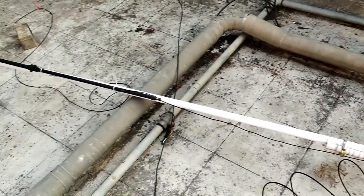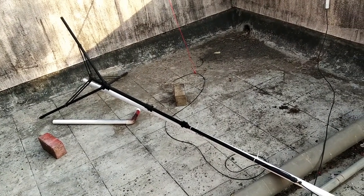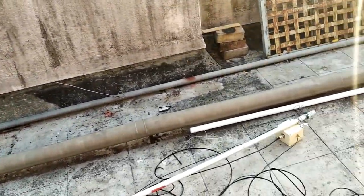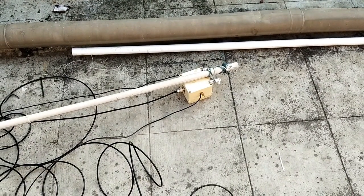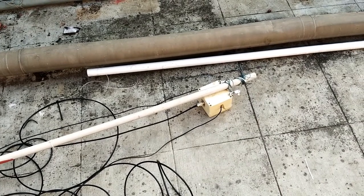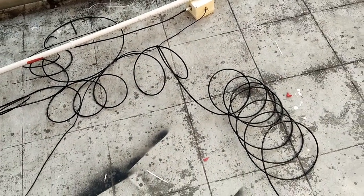There are some strings at the bottom and a tripod, but this is just for temporary testing, after which I will install the PVC pipe onto the parapet wall. Here is the centerpiece — it's just a 4x4 PVC enclosure. It's waterproof and there is an SO239 at the bottom and wing nuts at the side. The wire cut is a little more than 5 meters on each side.